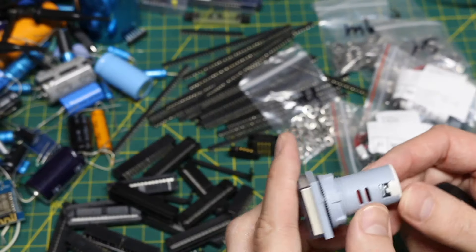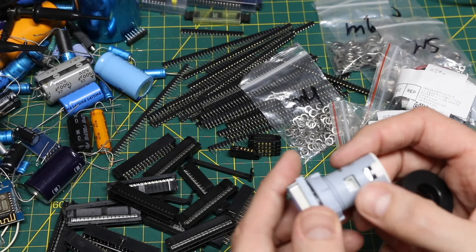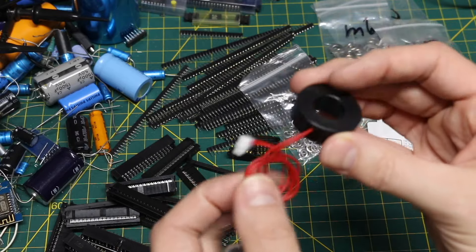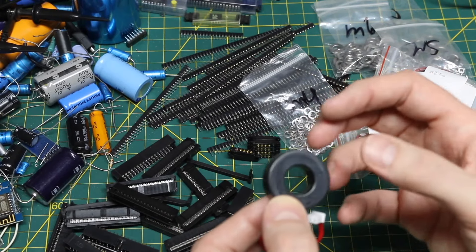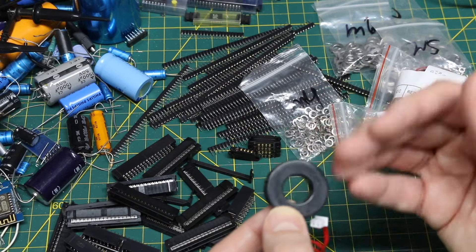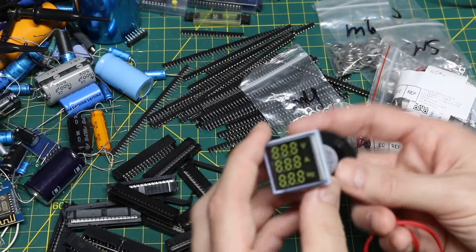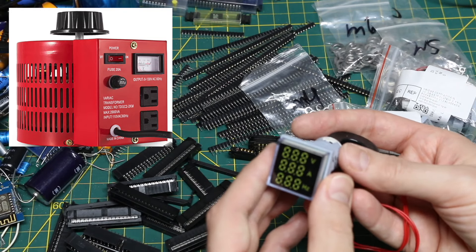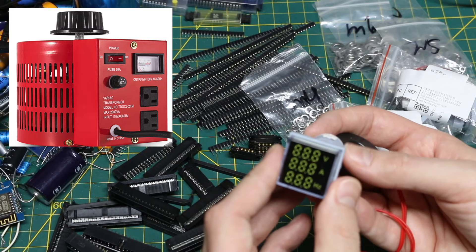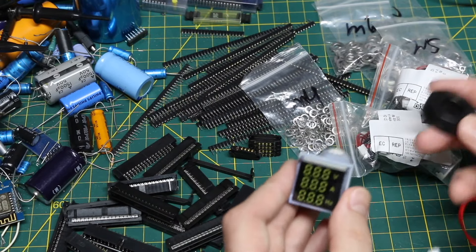The voltage terminals are on the side with screws to hook up to AC voltage. There's a JST-style two-pin connector which goes to this current transformer. It's not a split transformer so you have to break the connection you're measuring and run a wire through it. For lower current you might want to loop it around multiple times. Maybe I can use this on a Variac to give a digital readout of the voltage it's set to, since the one I have just has an analog needle. It would also be good to know the load current. I wanted several of these on hand - if they work well maybe I'll get more.